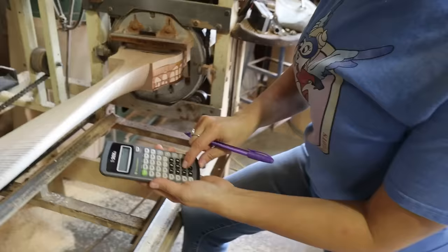So we have our SAE 1 bolt pattern, which is what our customer said he had, which is 4 3/8 on the spread, which is here. And then we have 3/8 bolts, and that's what these are. I tape over the other ones, otherwise I'll get distracted. So the bolt pattern is lined up so that the laser runs through center of the tip, center of bolt, center of this bolt, center of that bolt, and then the center of that tip.